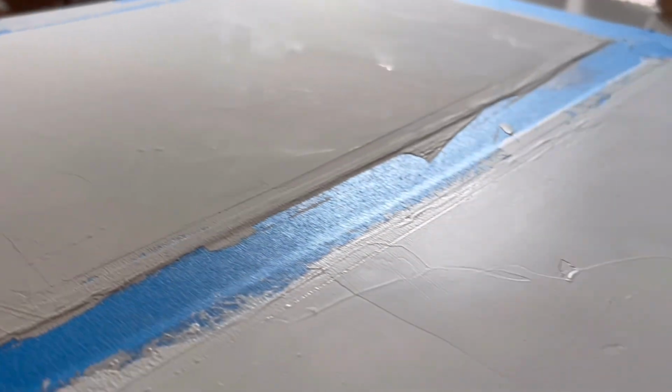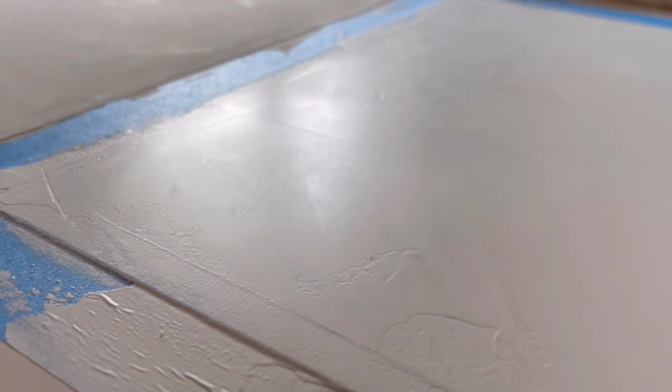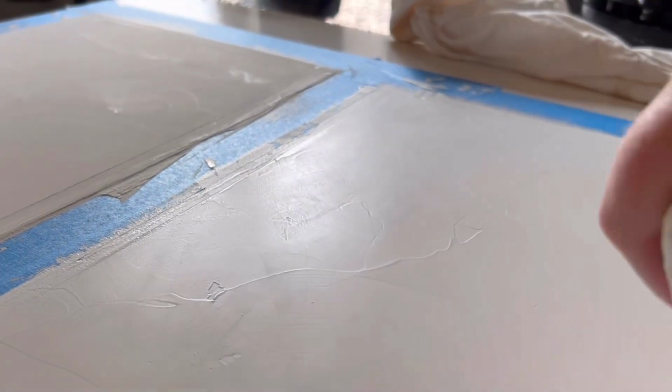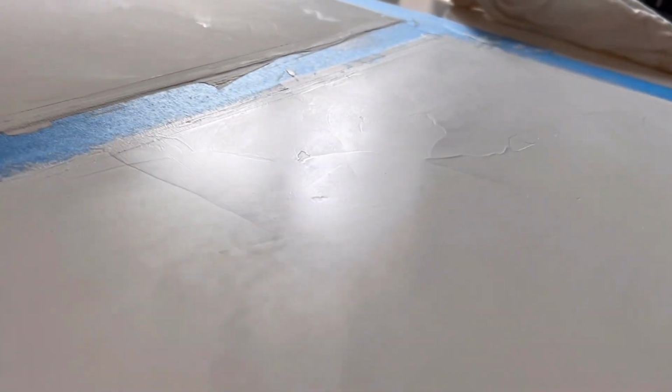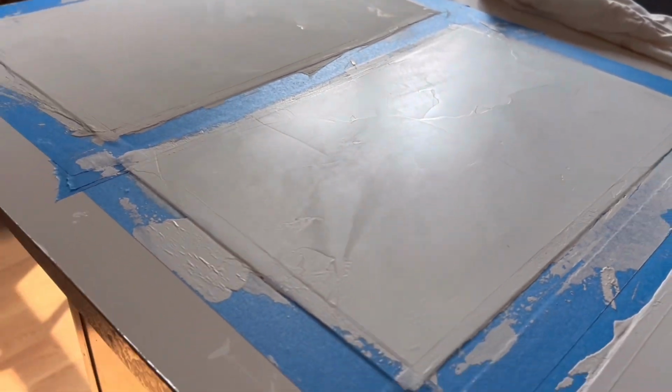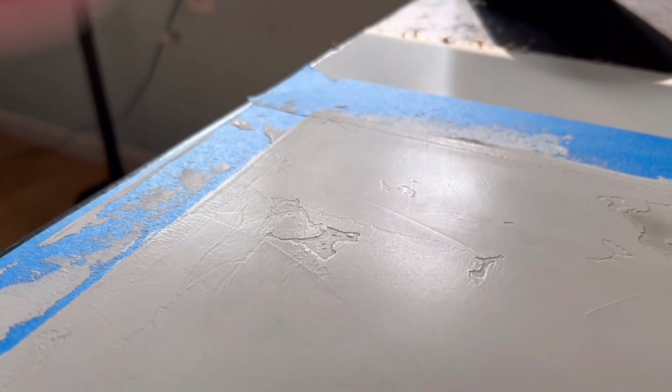You can see that I used my drill with a polishing bonnet on it. That is the way that I would polish it on a larger wall, just to save my energy. But another way to do it is to polish it actually with pressure and burnish it with your trowel. I may use both methods. I may follow up the polishing with my drill with the trowel, just to get some final real sparky streaks. And I just wanted to show you can actually polish it with a rag, a soft clean rag. I just wanted to show you how easily this polishes.